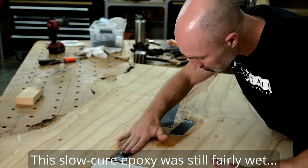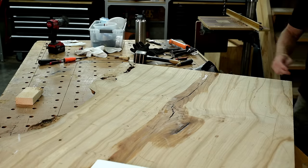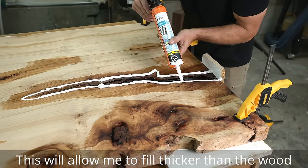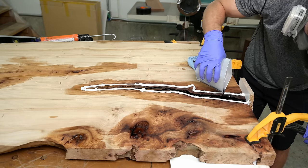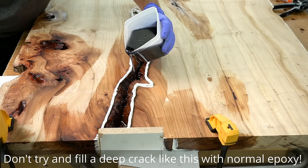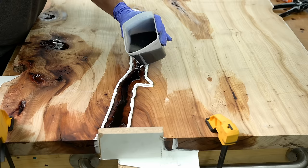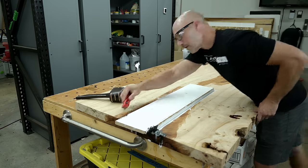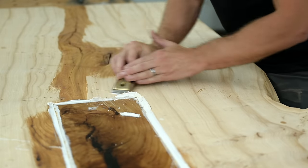In the past I've had good luck sealing small cracks with gorilla tape or good quality duct tape — the epoxy just needs to be relatively dry. As far as the top, I'm doing a caulk trick here because I want to maximize the thickness of this slab, which will allow me to over-pour the epoxy slightly without it running all over the table. This crack is about two and a quarter inches deep, and instead of using a tabletop epoxy I'm using the Super Clear Epoxy deep pour resin. This lets me pour the entire crack in one shot and gives me an essentially perfectly clear pour with really reduced bubbles.